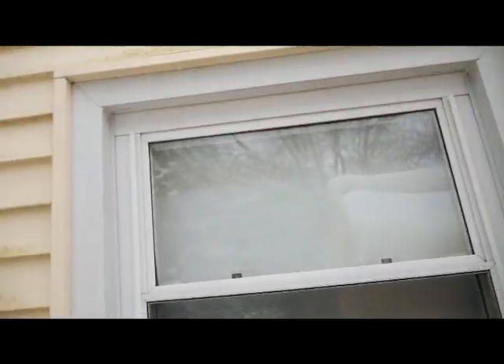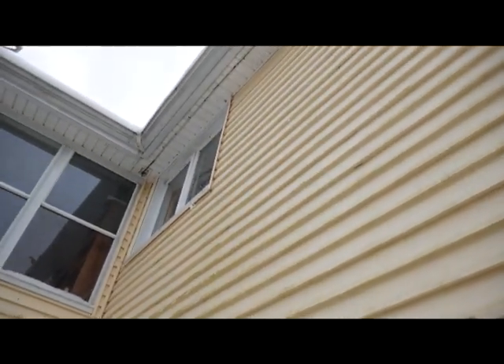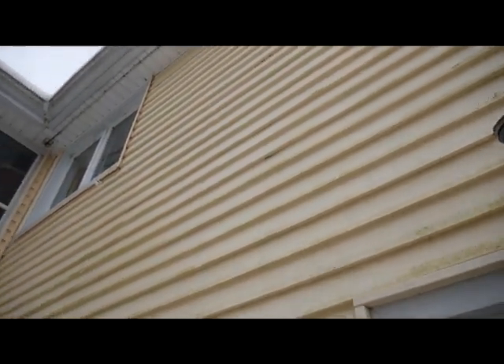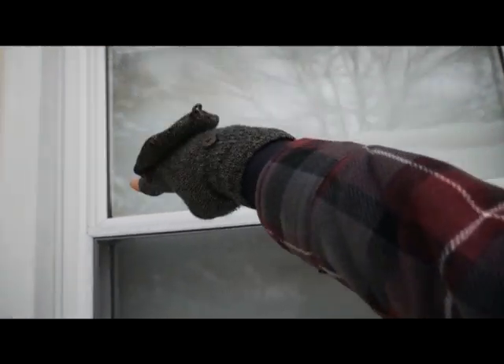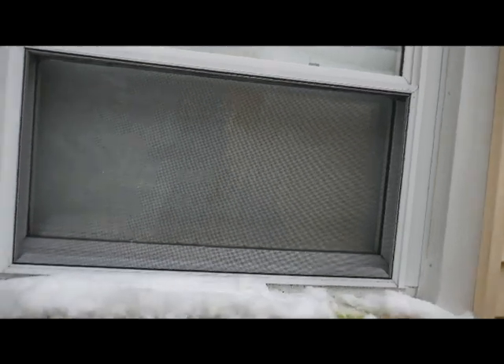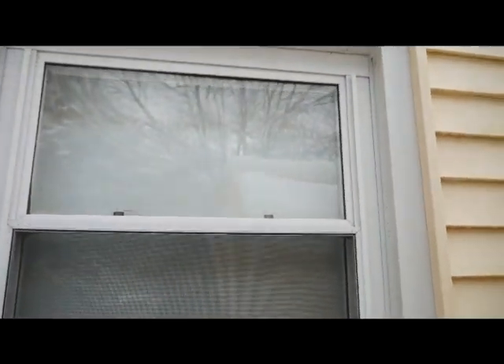Don't run the cord in through a door. Go upstairs, unravel the cord, and drop it down from inside the house — don't try to toss it up from outside. Be smart, do it in one shot, nice and fast. If you want to run a cord through a ground-floor window, cut pieces of two-by-three to fit inside the window frame on each side so it can't be shimmied open, or use the metal brackets people use for air conditioners.